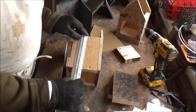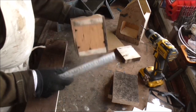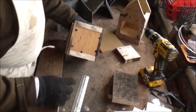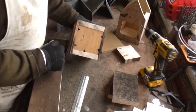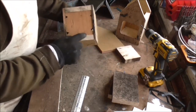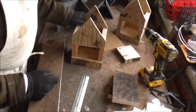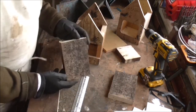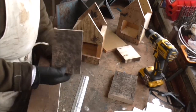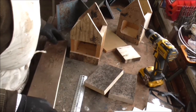The length of these is six inches, but again it's not critical — you can have it a bit shorter or longer. The floor needs drainage holes so any water runs out. I used to drill holes but now I just cut little V-slots in the sides on the bandsaw — it's much quicker and easier. You don't have to be particular with these things; they're a piece of cake to make. You can use any old wood — this is from an old coal bunker I broke up the other day.